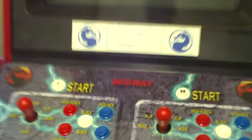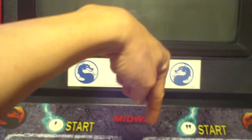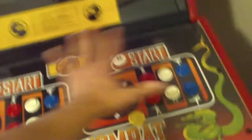As far as the top goes, these are actual metal control panels. I'm not sure how familiar Haunted360 is with these things, but they're made from the factory with bolts installed, and they come down through the metal control panel, and they don't have anything on top. So the top is nice and smooth, and you just drop them through these pre-drilled holes in the wooden control panel, and then you screw the bolts on the back. So he would just have to build a wooden one like I did here, out of 3/4 inch MDF, and just drill all the holes.